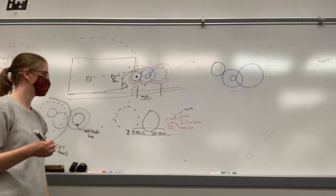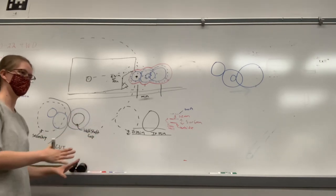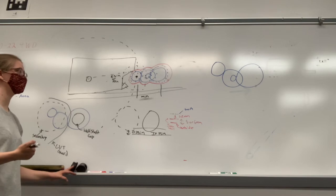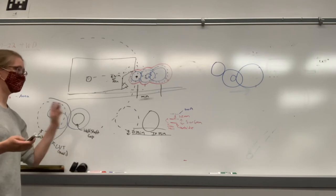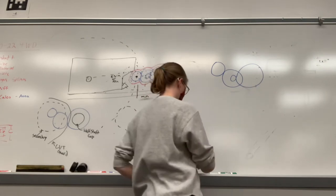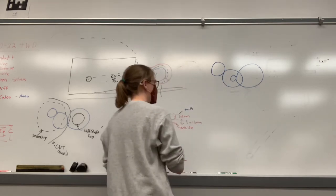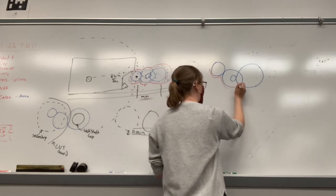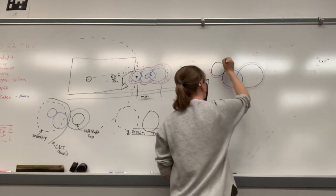Is all this in CAD already in the previous design? Yes, all of this is in the master sketch. All of this happens in the master sketch. Once you get to the layout you like, you have these pitch diameters, your teeth diameters, and now you have this curve of your casing — or your theoretical casing minimum width. So now you start thinking about how to actually design the casing.